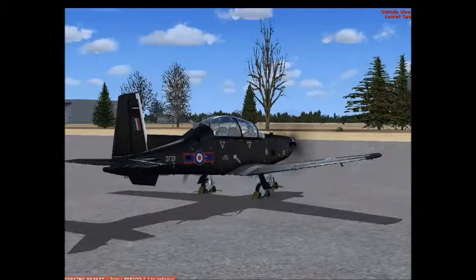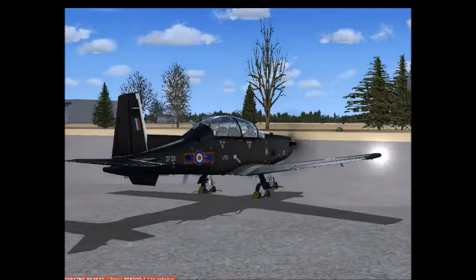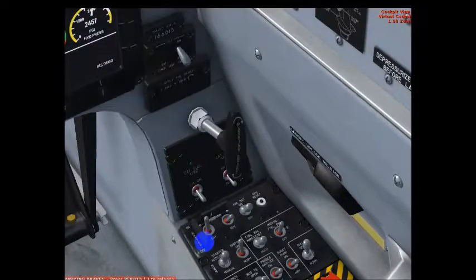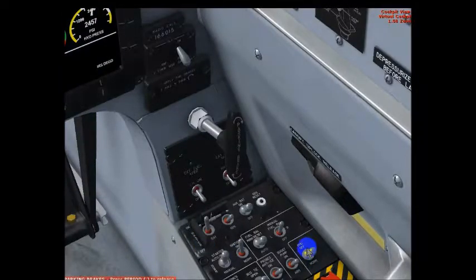We come outside, we have a spinning propeller, we have workable flight control surfaces. That doesn't matter because the flight control surfaces are not powered by the engine or anything. And there we go. We push it down, starter goes back into the normal position. All right, our PMU, we'll bring that down into the normal position. All right, that is item number 8. And we have an operable engine, ladies and gentlemen. We check our engine instruments.